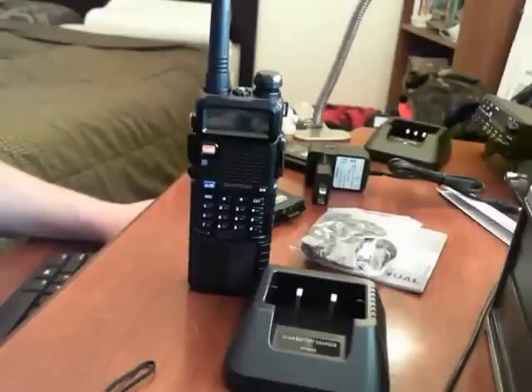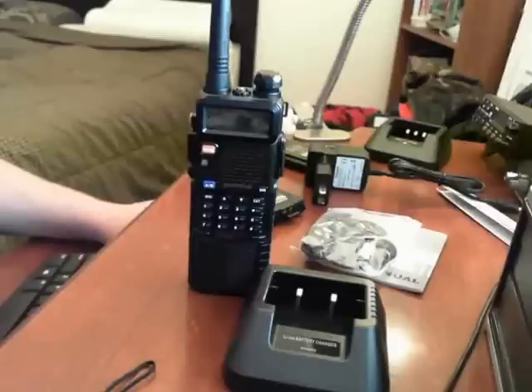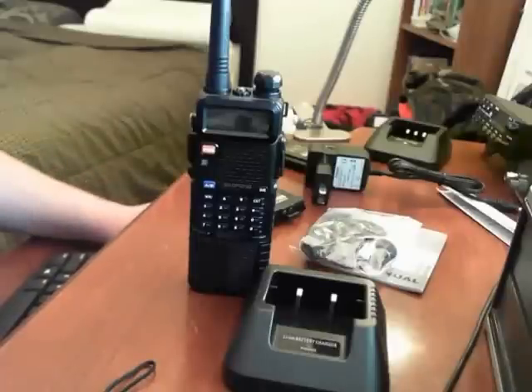From testing this one, I was able to hit a repeater and hear the repeater identification clearly on low power — that's one watt — and that repeater is 11.3 miles away in Goshen. If you showed me a blank map of Connecticut and said 'where's Goshen,' I'd have no clue — all I know is it's 11.3 miles southwest of where I am right now.